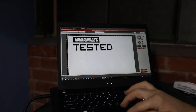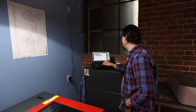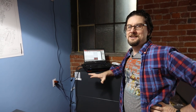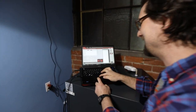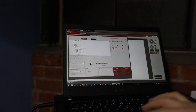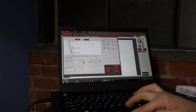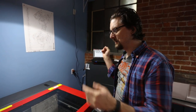The red here is going to be cut, and the black is going to be a raster — it's going to cut down a little bit into the wood. The other thing I really like is that it has a really big materials database. Anyone who's done laser cutting knows that speeds and power are always a question — what should they be? I've been in a lot of hackerspaces where they have the cheaper lasers with a chart on the wall. It's all right here. You can literally just go in, pick what you have — we have wood, and I believe this is birch plywood — pick birch, type in the thickness: 0.125. And you can tweak all of this, but part of what getting this system gets you is that they've figured out a lot of this stuff for you. So we have our thickness and the type of wood in there, ready to go.